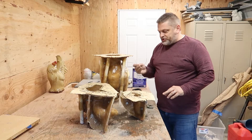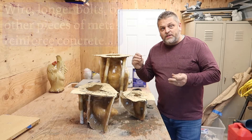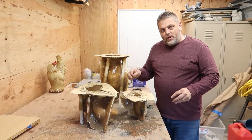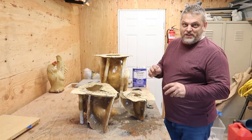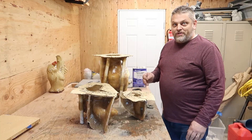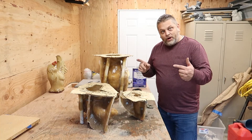The last thing I like to do is have some little strips of wire — I'll often bend them over so they're kind of double thick. As I'm pouring the concrete, I'll put these wires into the more breakable parts, whether it's a leg or an ear, some thinner parts. The wire adds strength to the concrete, and oftentimes it will save a leg or an ear from falling off if there's an accident and something gets dropped. It still might crack, but at least that piece stays on and you can make it look better without having a missing leg or missing rabbit ear.